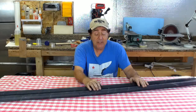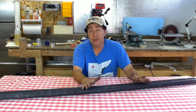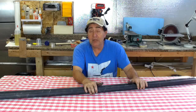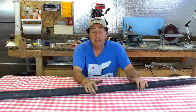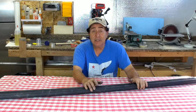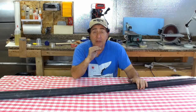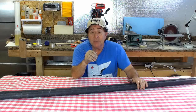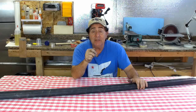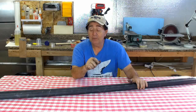This is the remainder of the tubing that goes in the wing itself — all of the tubing I need for the wing is complete now. I'll be moving on to making tubing for the pilot's cage, which should prove to be interesting because we're going to use a slightly different process. I'm going to be using the sandwich panel style — a layer of fiberglass, foam core, and then some carbon fiber and Kevlar on the outside — to make extremely high strength-to-weight ratio tubing for the pilot's cage.